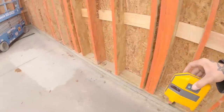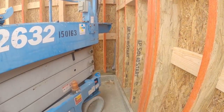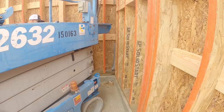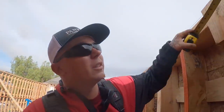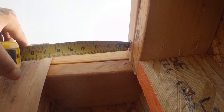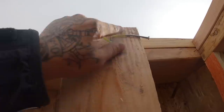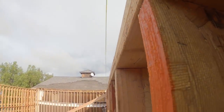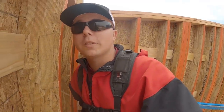We're using the PLS laser. It's set up right down at the bottom at inch and a quarter, so we're looking for inch and a quarter. That one we're reading right around inch and a sixteenth - so we're three sixteenths off on this side, and we can rack this side. We're also not tied into the building and none of these are nailed. Here's how we have our string line set up: we have a block nailed on there, string line ran all the way down, same thing over there. We use a 2x4 to gauge in here, string these, nail the braces. Super effective and easy way of doing it. As you can see, these walls are pretty dang laser straight.